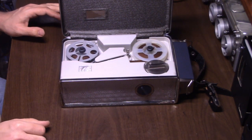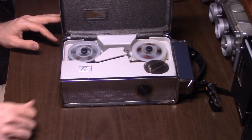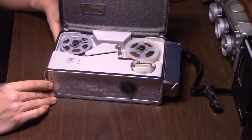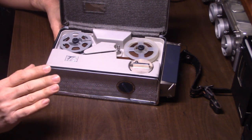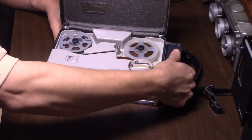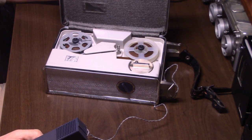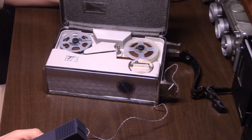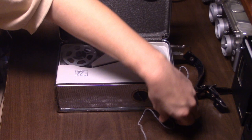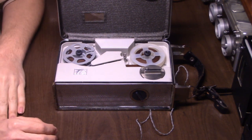When I first got this recorder, I was amazed — the mechanical section worked perfectly. The rewind is noisy, but aside from that, the mechanical section was working perfectly. The rubber in this recorder — I can't believe how good it is. The original belt isn't even loose. The pinch roller's rubber feels fresh and has lasted surprisingly well. The mechanics just work perfectly — the rewind has plenty of torque, the speed is consistent, and the motor and governor are operating beautifully.